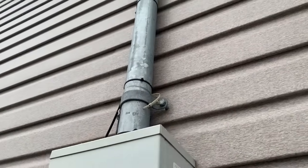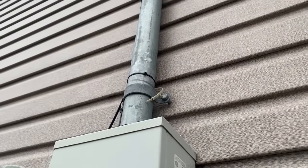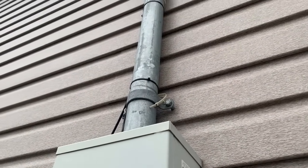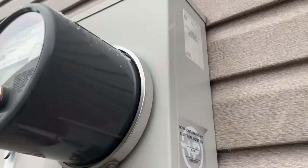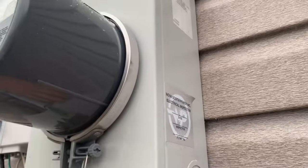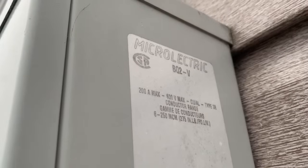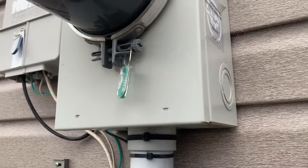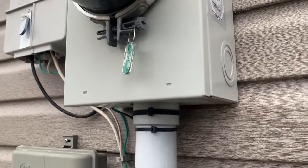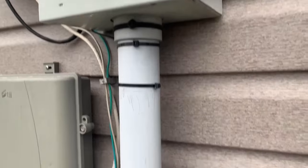The first thing you shouldn't bother looking at is the top of the service, because a lot of times you'll have a pipe that runs up and they're all the same size — you simply can't tell from that. The meter box is sometimes marked 100 or 200 amps, so that's the first place you can look. You can see this one says 200 amp max, but that doesn't necessarily mean this is a 200 amp service, because there can be different size conductors in it.